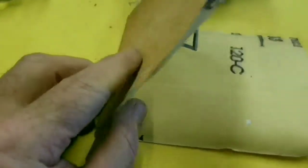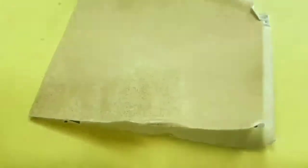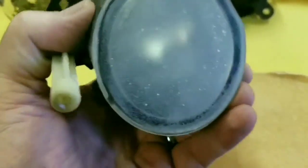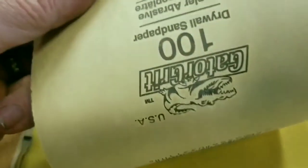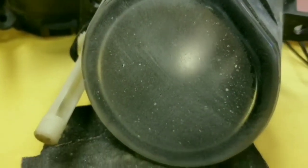Starting out really coarse here because they're so deeply pitted. This is 120 grit sandpaper. Let's just start grinding off the whole top layer — you have to get past all of those pits. These pits are so bad that now I'm going all the way back to 100 grit drywall sandpaper to take off the top layer a little bit faster.